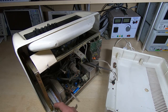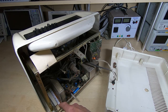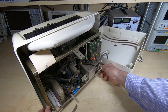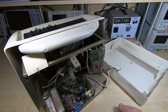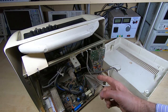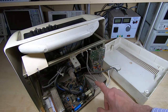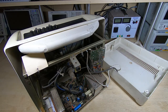Although it's got a floating chassis, this is all bent. What you can do is slack off these two wing nuts and the entire bottom board assembly slides out for access. I'll get the rear out of the way and loosen these two. It's very dirty. I'm going to quickly test the CRT — going through the usual fault finding. Most likely it's a fault with the power supply or line output stage.